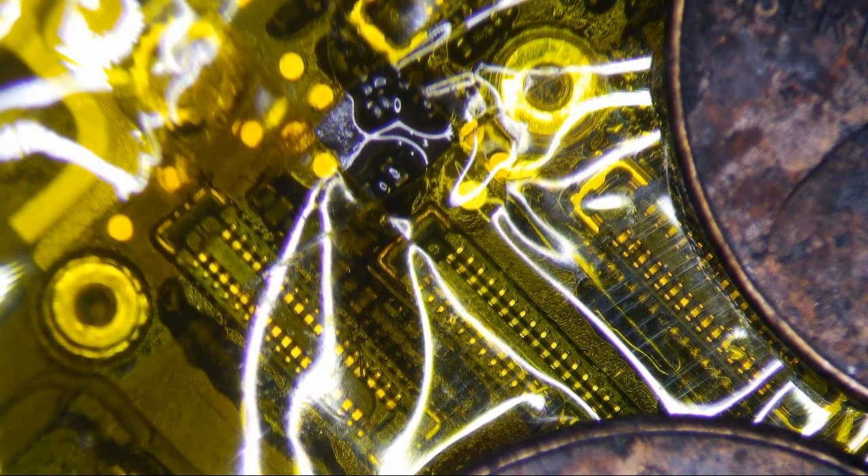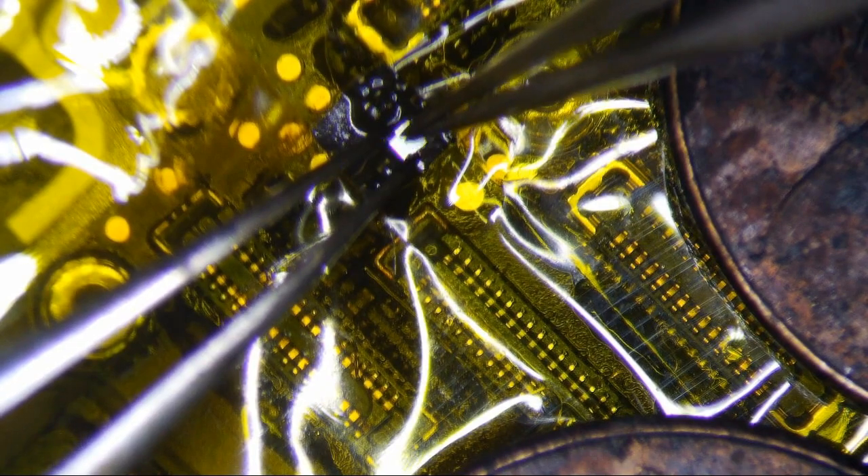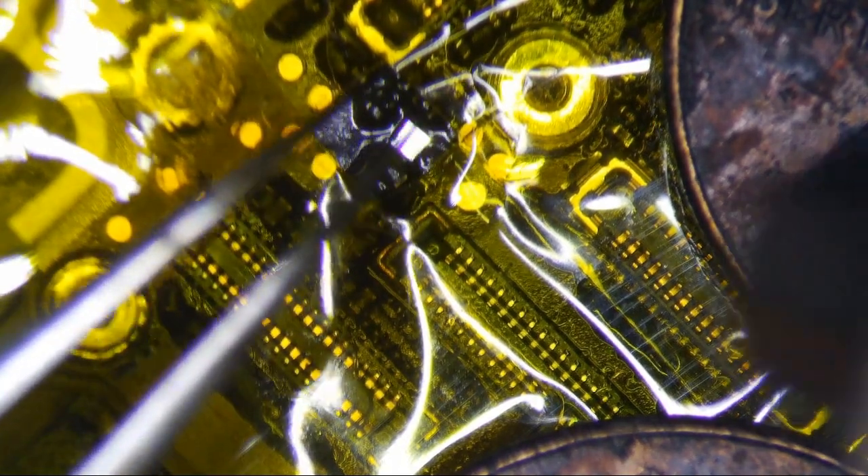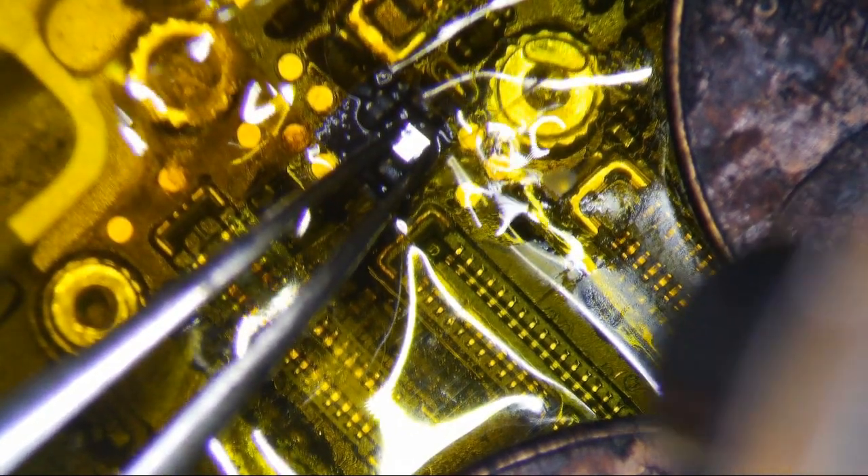So I got my new LDO here. I'm going to make sure it's oriented correctly — the dot goes to the top left if it's facing this way. Let's heat it back, let's try to be quick. I hate doing these actually, but this one seems to be a little bit better than the touch LDO. You really just want to get in and get out, because these things start wiggling. I'm going to hold it like this, see if I can get it to connect real quick — lots of high heat. Burning my fingers because the cap deflects the heat.